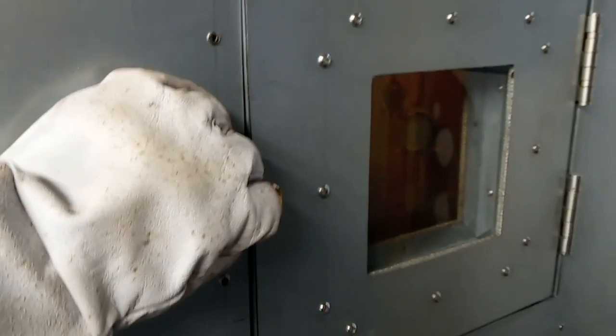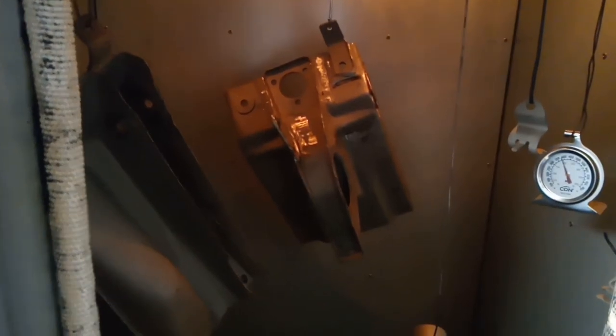Okay, this outgassing stage serves a couple of purposes. It's a key preparation for powder coating. It is one to ensure that any gases that would be released during the curing process are forced out prior to putting it through the curing process. So this is where I run it at 20 degrees higher temperature for 15 minutes longer than the cure time of the powder. The other thing it will do is it will force out any oils or other contaminants in the surface, which can then be removed by a second media blasting stage before final degrease.